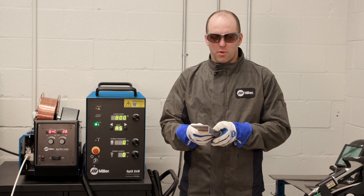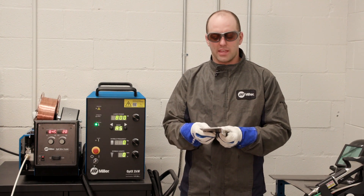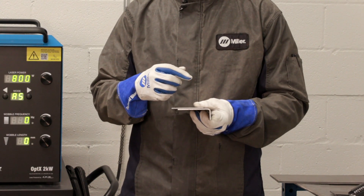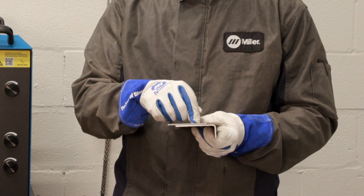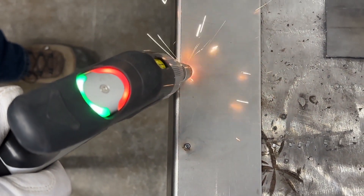As you look at different welding processes like MIG or TIG, if you're doing through-sheet tacking you're going to have to do what's called a plug weld — you're going to have to drill a hole or have a slot machined or laser cut into that. With the laser welding system, we can now just penetrate right through the part without filler metal and join those two pieces.